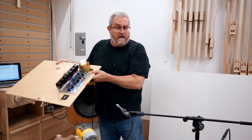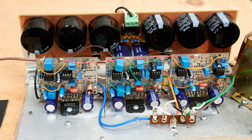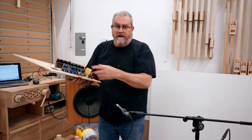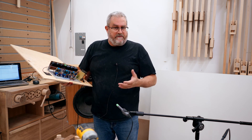This is the back panel from the other one that I started taking apart, just to show this. These are LM3886 — three of them — one for the woofer, one for the tweeter, one for the midrange. Also on these boards are crossovers: one for the woofer, one for the midrange, one for the tweeter. And they have a potentiometer so that you can adjust the volume on each one.